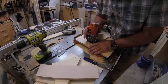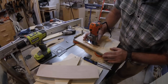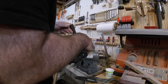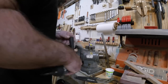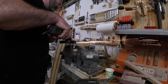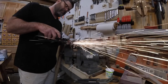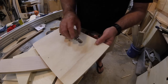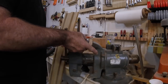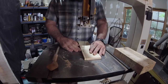I also needed a 7/8-inch router bit to do this channel correctly, but I didn't want to order one or drive the 75-mile round trip to the place I knew that had one. Instead, I used a regular 5/8-inch bolt and ground two sides of the head with an angle grinder. After a couple of test fits, I got the bolt nice and snug in the slot. I also didn't have a washer to fit the 5/8-inch bolt, so I made a couple out of fender washers using a step bit.